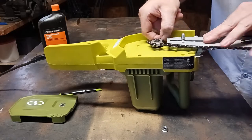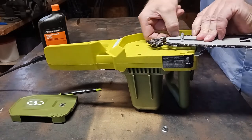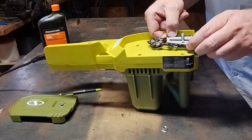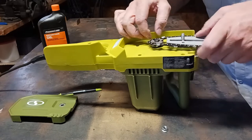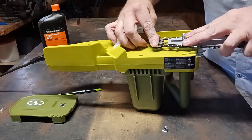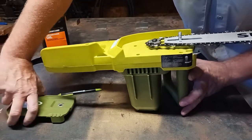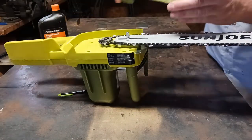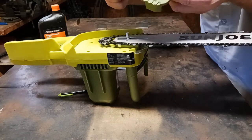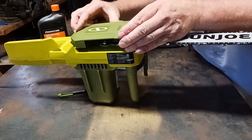Make sure that everything's in place. Once you do, make sure that the blade's teeth are in the channel guides when you put that cover on, because otherwise you'll have to take everything back apart. Also note that the cover has a little insert here — it's not a washer that pops off.